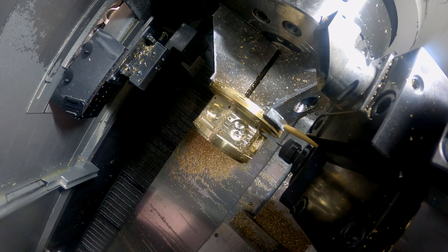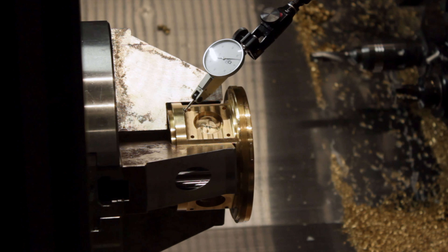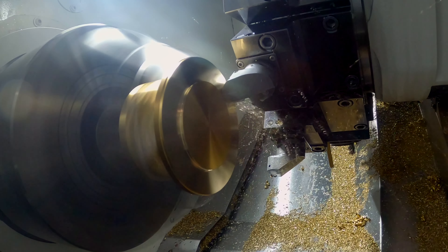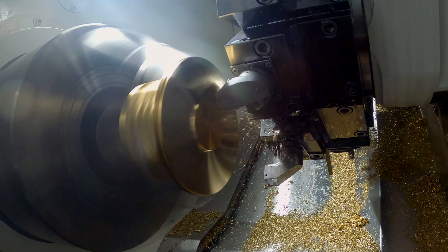I did all the features I could from one side, turned around, and used a dial off that flat which became the datum for the number one piston. So essentially it was so we had a base plate to put all the parts onto. Yeah, and it sets whether the whole thing is going to work or not.